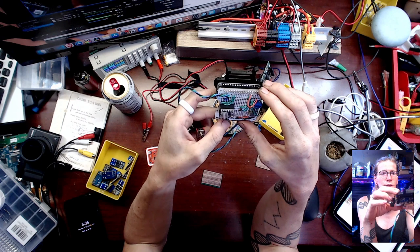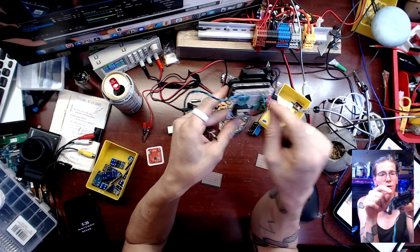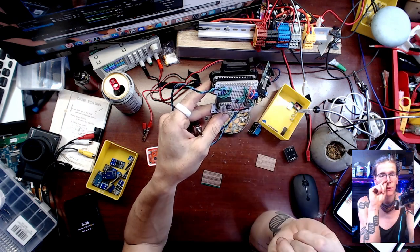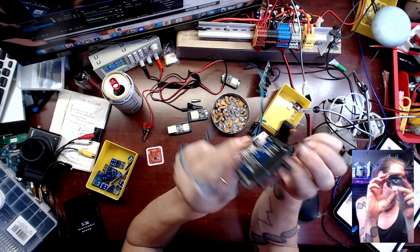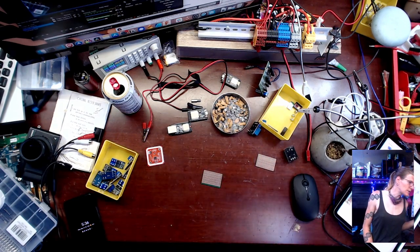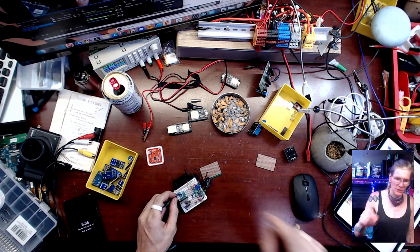Anyways, what was I talking about? Oh yeah, this one's just a regular breadboard. You have the vertical connections, and then you have a power and ground rail and a power and ground rail down here, and then the separation in the middle. So this is 5: 1, 2, 3, 4, 5. I wonder what my motor is, too. Love to have my motor for this. So I'm going to actually snip this.